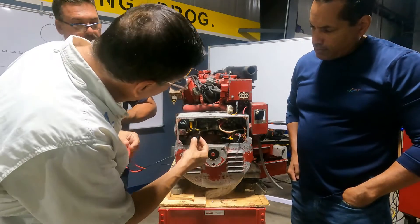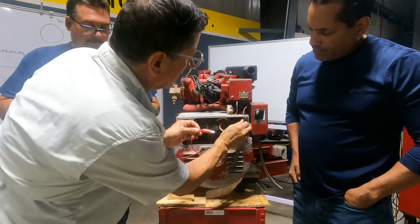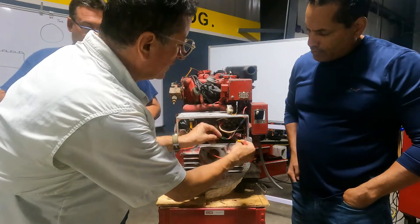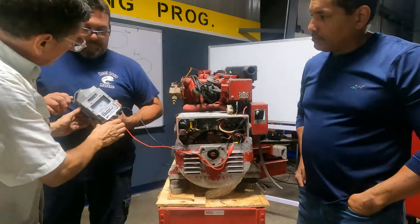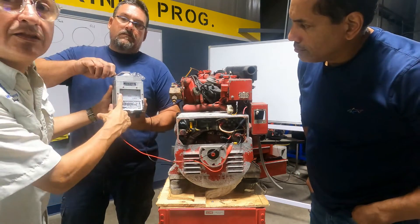The process is: one terminal into the ground, into the case, and the other one into the hub. Look at this — we have zero in this point and infinite in this point.